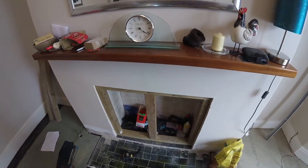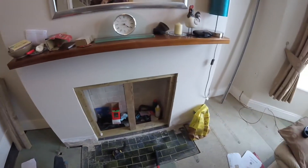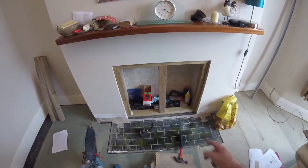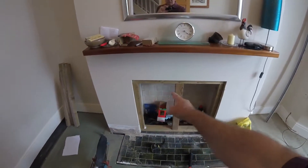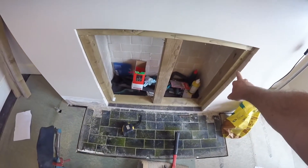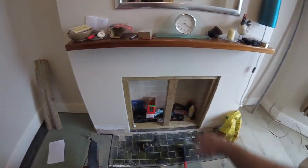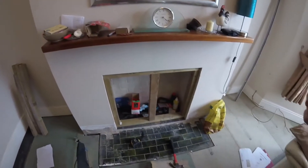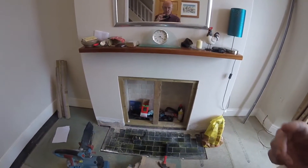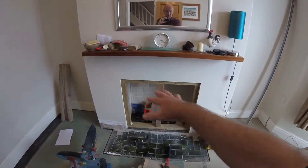So that comes to around 31.5mm — I'll have to make sure that's accurate because I'm going to cover that over to match the rest of the chimney breast. Once the frame is fixed I'm going to leave it open for the time being, because next door is having their roof done and at the same time we're having the chimney stack taken down, so there's a good chance there'll be bits of debris, soot and all sorts of rubbish coming down.